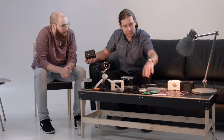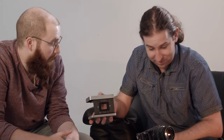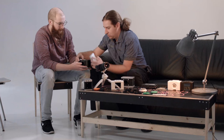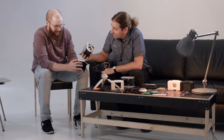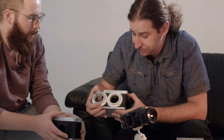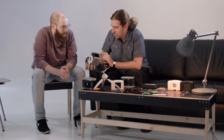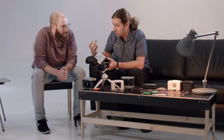The idea is a really rugged, production-ready enclosure. What replaces the Skeleton inside is a bent aluminum metal sheet, and around that we put the actual outside enclosure — we call these the inner skin and the outer skin. Parts on the bottom and top put everything into a sandwich-like design. The outer skin revolves around the rest of the camera, and it all attaches together and forms one unit when screwed together properly. Every part is kept modular: the lens mount is a separate part you can easily swap out, and the connector plates are custom designed. With plug-in modules and extension shields at the side, you can still swap out parts.